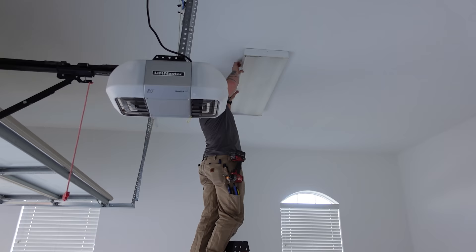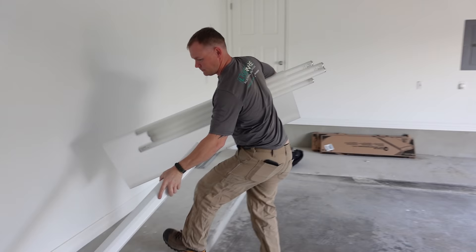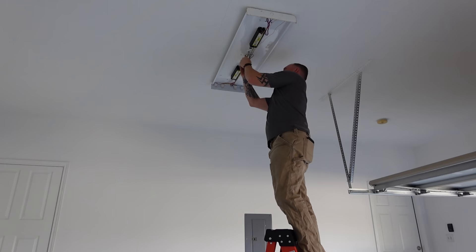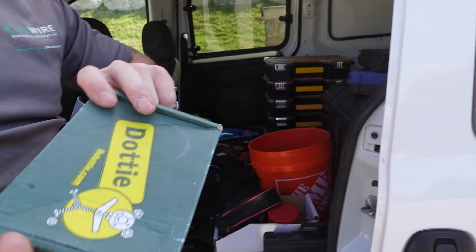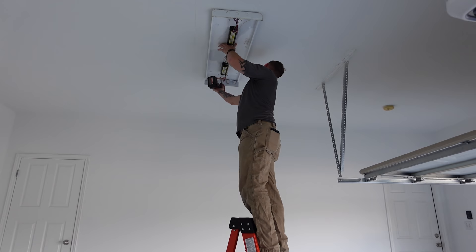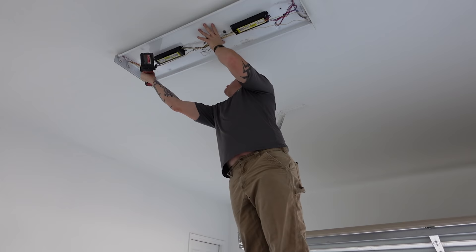The first thing I'm going to do is go up and take the existing fixtures out. A lot of times when you take the cover off or the lens off one of these fixtures, you'll break them. You're going to find that they're screwed into the sheetrock with toggle bolts rather than screwed into wood. When you unscrew toggle bolts, there's a methodology. You have to pull down the fixture a little bit and keep pressure with your drill — pushing up with your drill and pulling down with the fixture. If you just push up, the thing's just going to sit and spin.